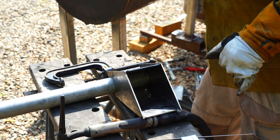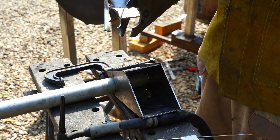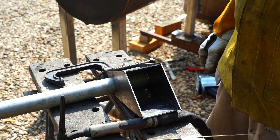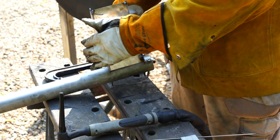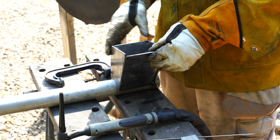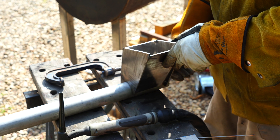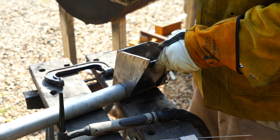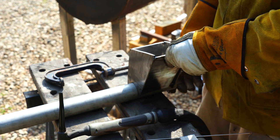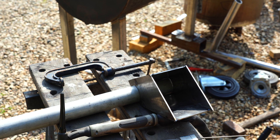I was going for all types of special angles and what have you, and it turned out to be a complete nightmare. So basically just stick to what's known and proven - we cut out the end plates earlier, cut three and a half inches there and three and a half inches there, straight plates, tack them in and slid them on, and it's working absolutely fine. It might have a little bit of a twist, but that's sorted. We want a little bit of gap so we can undo the screws, and we've also got to think about the thickness of the bearing before we cut in.